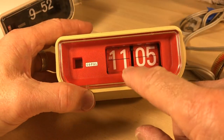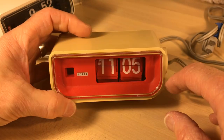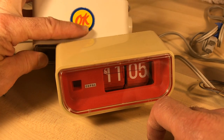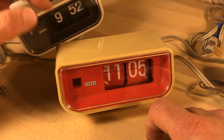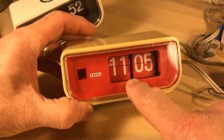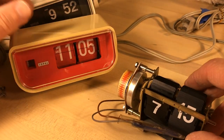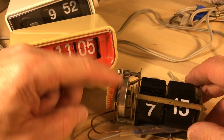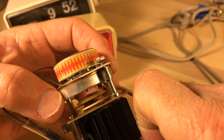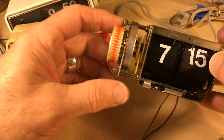The next thing is this Japanese clock — I'm really looking forward to getting in here and putting the motor from the okay clock into here to turn this one into a United States running clock. This will become the US clock, and this one will remain for 220 volts at 50 hertz — so this one will remain the European version.